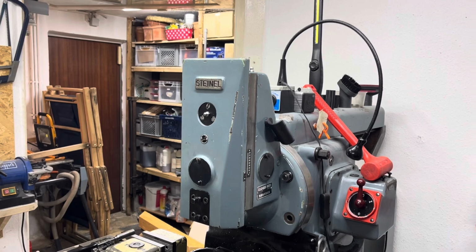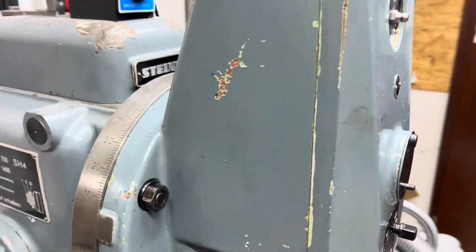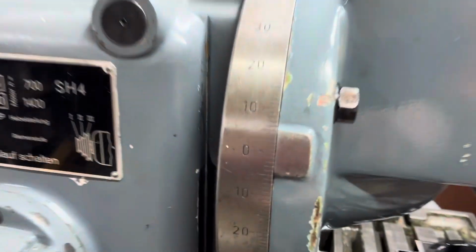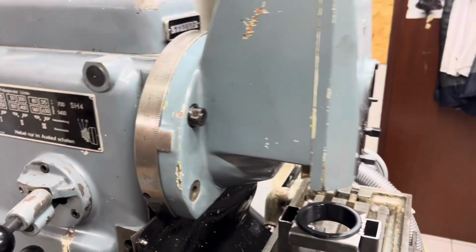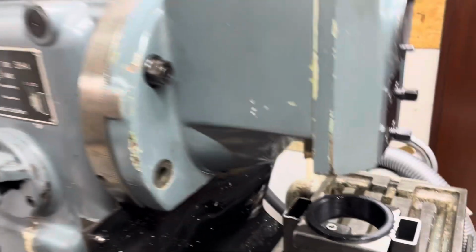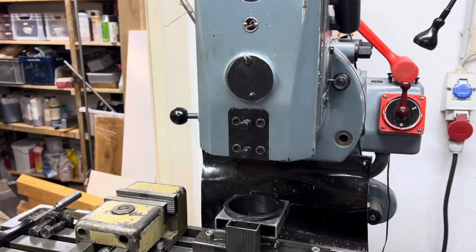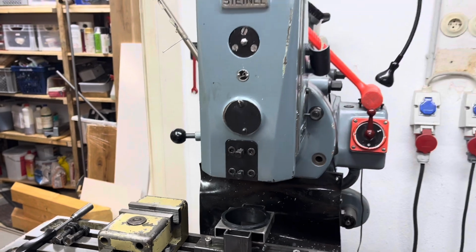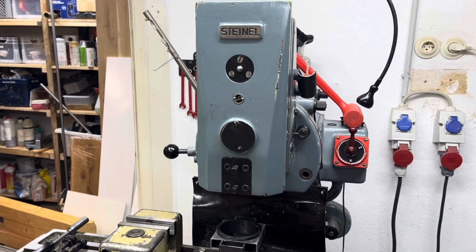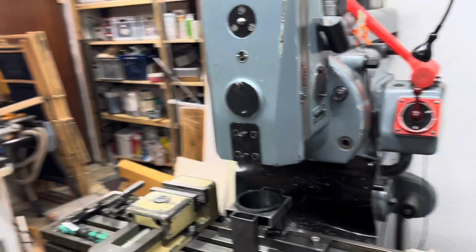And all that remains now is to clean the bearing that's inside there, to tram it in and to make a mark here. There never was one, actually. So it's virgin alignment, obviously. And then, well, it's about some tooling, right? I mean, I don't know. I just ordered some plain HSS steel, and I will see what I make of it. There will be some keyway slotting actions on my project list, and let's see how I put together some tooling here, but let's do it one step at a time.